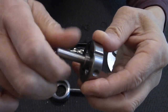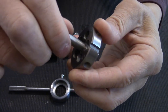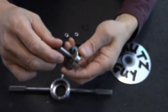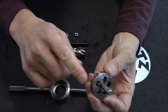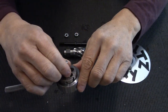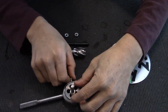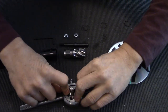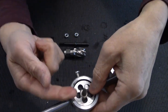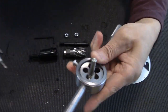Make sure that you insert the pilot deep enough — it shows four threads cut on the die, and this looks about right. You'll see there's an indent on the die; make sure it lines up with the screw. Also make sure that the print is facing outwards.